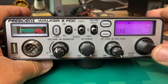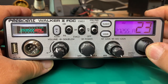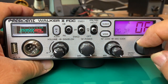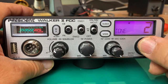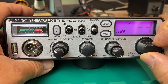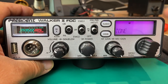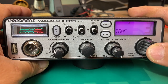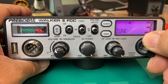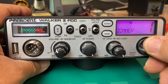This may be hard to hear on camera. This is our highest tone setting — it allows for a sharper-sounding voice. If this is too much high-frequency response — a lot of us have different hearing and some of us can't handle high-pitched frequencies — you can push and hold and dial that tone down. You can even go below that and take out most of those high frequencies. If you need a little more high frequency because you're hard of hearing, you can turn it back up. It's a very nice feature, especially in a mobile environment depending on where your radio is mounted.